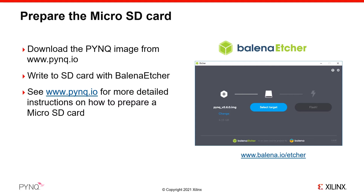To write a PYNQ image to an SD card, first download the zipped PYNQ image file for your board. You can't copy the image directly to an SD card — instead you need to use an application that can format and make a bootable SD card. There are many applications that can be used for doing this. If you are using Windows, we recommend the free program Balena Etcher. First, unzip the PYNQ image that you downloaded to get a .img image file.